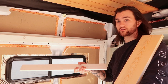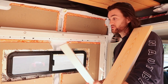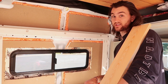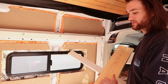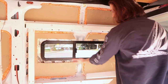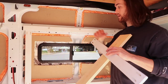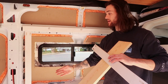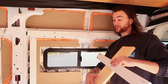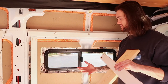Back at it — Day 2, CR Lawrence window, time to frame it. We have some ideas, subject to change. The goal is to use these one-by-sixes and frame out the outside of this so we'll have a nice window sill. The one-by-six will come out further than our frame, and a one-by-four would have been too short. So we're going with one-by-six and will have to trim it lengthwise to make it fit, which isn't going to be fun, but I think it's doable.